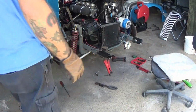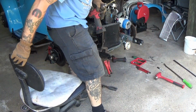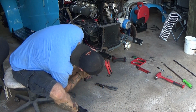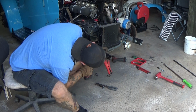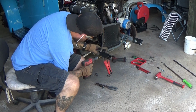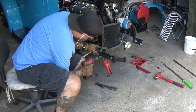So now it's going to be on to making the other bracket and making it match after I cut off that end of the strap steel and just making them the same. And then I have some pipe back there. I have to find which one's going to be the right diameter, right thickness. I'll make a cross brace across it to try and help strengthen the front end of this too, and also help support the weight of where this heavier bumper is going to be lying. But I'm going to go ahead and jump into that now.